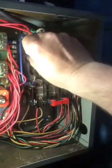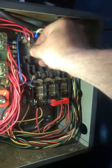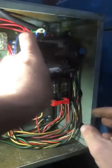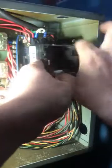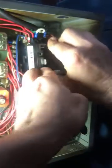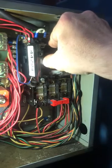Now we can slide this bad boy right back in there where it used to be, just like so. We'll take our contact plate, move our wires out of the way, and put our contactor back in. Make sure our coil wire is out of the way, every wire is out of the way, and we push that in — and that should engage.